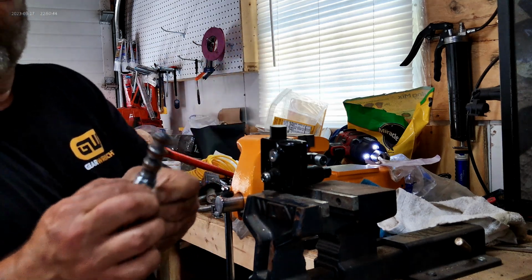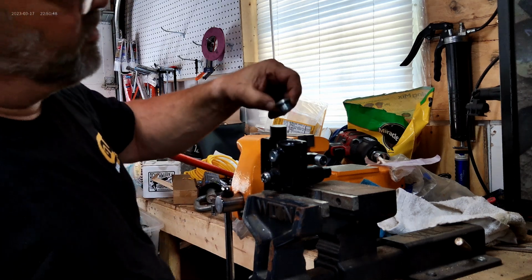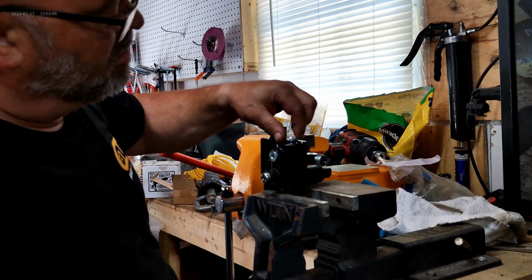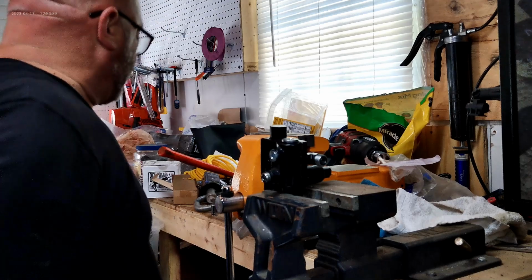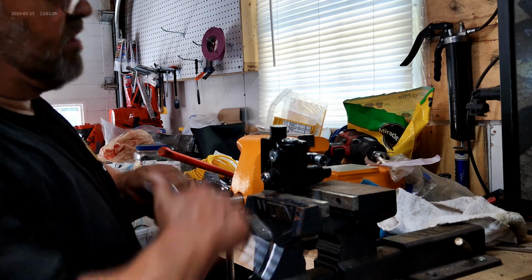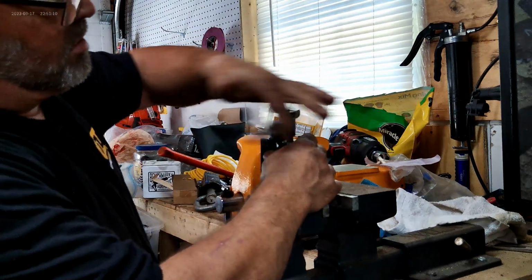This we're no longer going to use. The valve? That's it, we're out. Now we're going to install the larger plug, which is a 3/8. And you notice I'm not using a gun on these, just because you don't want to over tighten these, or they will leak. It's a good thing we're changing the fluid.